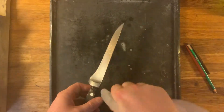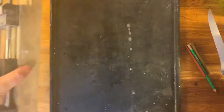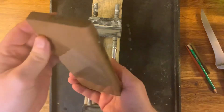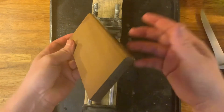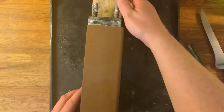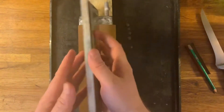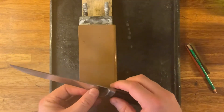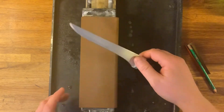For the other method, you do it with a whetstone, and this requires perhaps a bit more of an investment. I have my stone holder and a wood block to get some elevation. And then I have my old soaking stones, which as you can see have been rounded off on one side — that has been a very useful thing to have, but you need to do that to your stone. I've done that with my diamond lapping plate, which is an Atoma 140. The method for doing it this way is to just sharpen the recurve on the radius on the side of the stone.